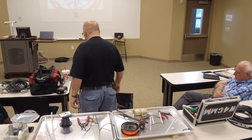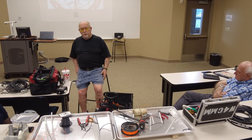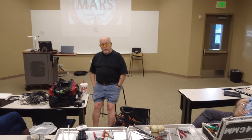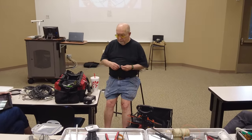I had one up that would go down as far as 3.3, and it went out a couple of trees a little further out. The thing about a horizontal loop is, the more efficient it is, the more inside area the loop has. So a horizontal loop antenna, the best it's going to be would be a complete circle at whatever height above ground you want to go. So if you have to do it, you can do anything. It doesn't have to be a square. It can do anything. And so it works pretty good.